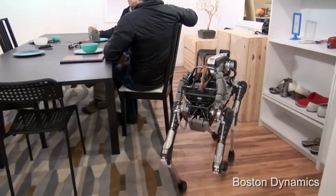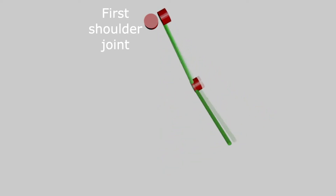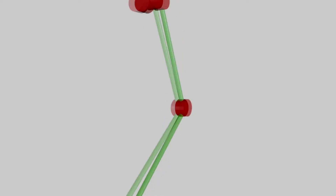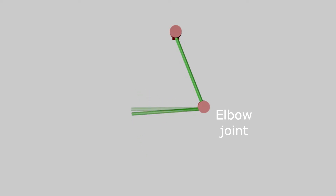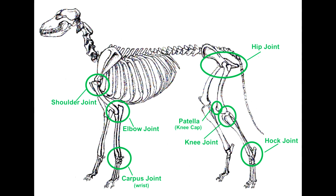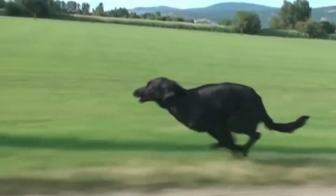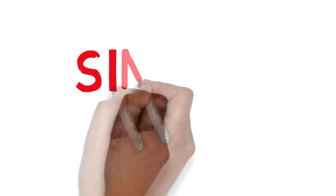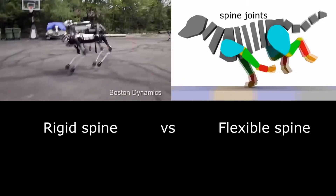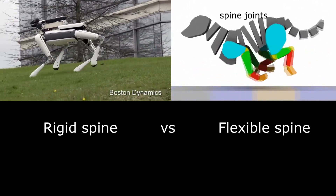Let's study what we see. Each paw of the robot has a total of three joints: the first one in the shoulder, moving the paw left and right; the second one in the shoulder as well, moving the paw backwards and forwards; and the last one is the elbow. You might realize that this is different from a quadruped animal, which has more joints. But this doesn't mean that the movement of a dog is more optimal — maybe it is more flexible. In fact, more joints demand more energy power and more complex movements, so let's keep it simple.